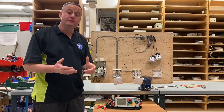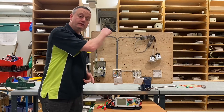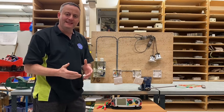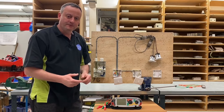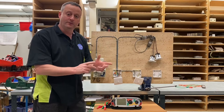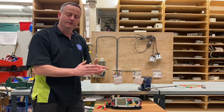Building up a series of videos using the two-plate method — where we take the line and neutral connection to the switch and then go from the switch to the actual lighting points. It makes it easier when fitting recessed LED down lights. We went from one-way, extended to two-way, and looked at the connections on the two-way lighting circuit using the two-plate method.